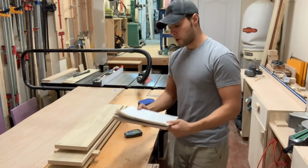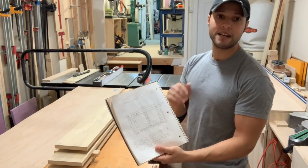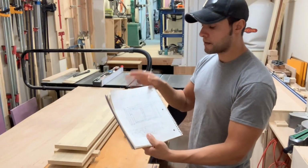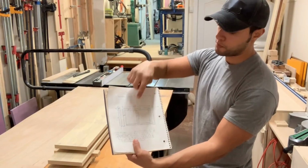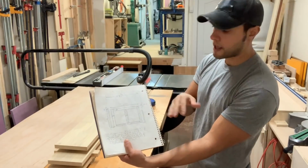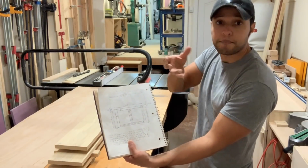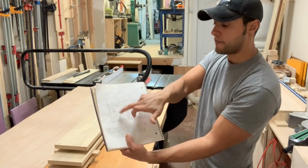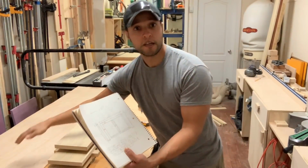So for that one, I'm going to title this one Baby Gate, because you can also make this for children. And I'm going to make it a shaker style type with recessed panels. It's going to look basically like one big cabinet door with a stile in the middle. And we're going to have 1/4-inch panels in between.